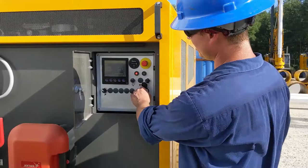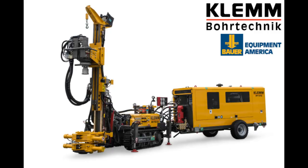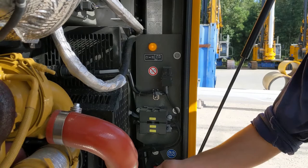To kill the rig, turn the ignition key switch to the left. At the very end, you have to hit your battery switch, but you have to make sure the light right here is off before you can kill the battery.